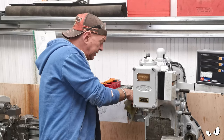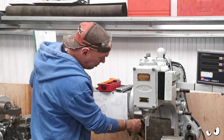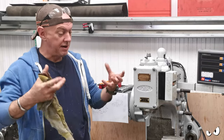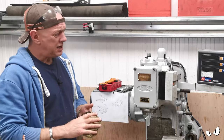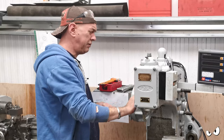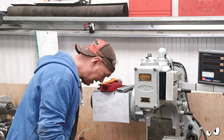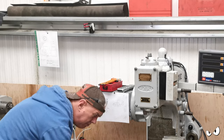The bearings are getting changed. I'm pretty sure it's the bearings because when I had it all apart originally I used that bearing puller, but I don't think it did any favors - the shoulders on it were catching on the collar that surrounds the taper roller bearing. I think it lifted it and damaged it. I should have replaced them then but I didn't, and that's what I'm doing now. I'm just giving it a spritz and a clean up because it is filthy - I want all the chips and everything else gone before I start taking covers off.